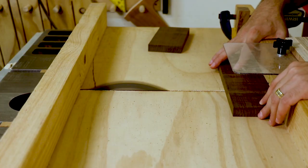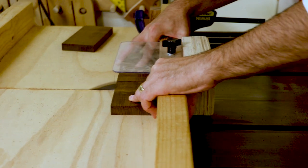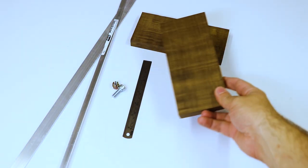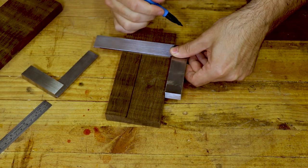After prepping it, I ended up with a clean, if not overly attractive, length of walnut. I cut that down to size on the table saw to get the two parts needed for the body. I'm still trying to increase my quality of work, so I used a black marker here to clearly mark out all the cuts that I was going to have to make.